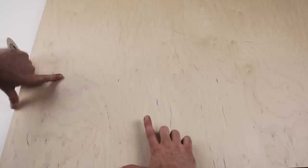Next up, the ply panel itself. So this is a half inch Baltic birch, I think they call it, or Euro ply. This is a good grade of ply that's great for cutting and engraving without giving any chip out or strange fuzzy behavior. It's nice and stable. So we're going to cut down here, and I've got this double-sided tape because I'm going to put tape up here and then flip it over so that when we cut out our states, they don't fly around, they don't become detached from our panel when we complete the cut.